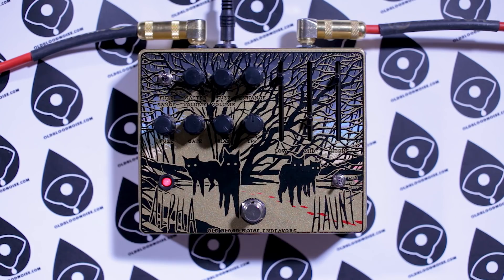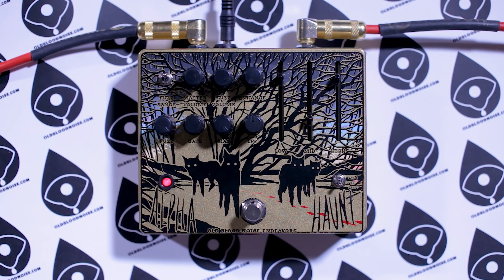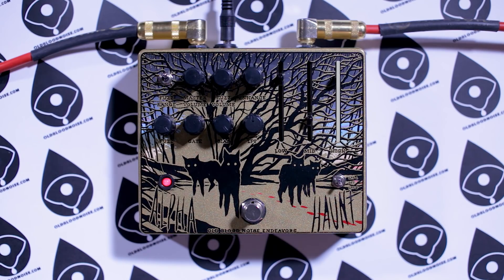There's an enhanced knob. Instead of a mix knob that blends from clean to fuzz, you've got two parallel signals: a volume for your fuzz and a volume for a transistor boost that's clean-ish. Basically you get a lot of volume and a little grit around the edges. Blend them to taste, then there's a master volume and a three-band EQ that affects both the transistor boosted signal we call enhance and the fuzz.